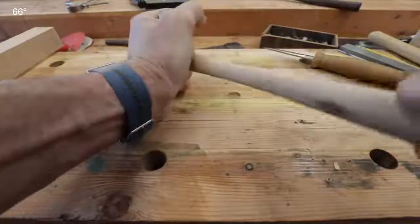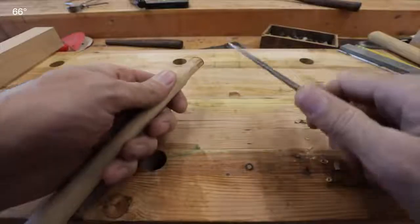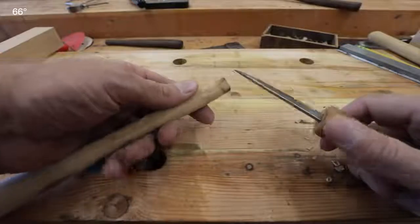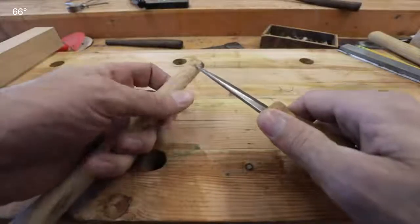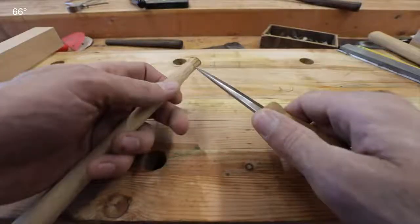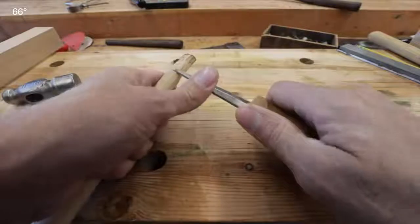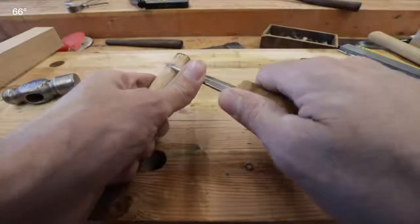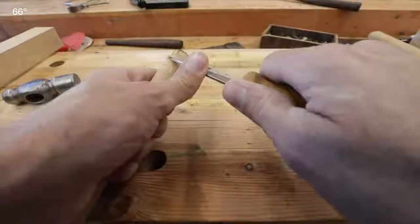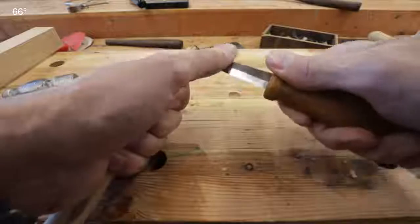You may have to do this many, many times, and this is where, if you do it right, your handle is not going to come loose on you. You can see the rub marks from the head — that looks good because we're coming into contact in almost all areas. It's actually burnishing the wood. This is where this little knife is so wonderful — very controllable. We're just matching what we have there. Take your time; if the grain changes on you, just come back at it.